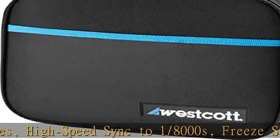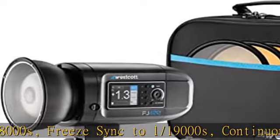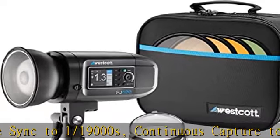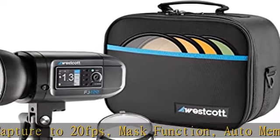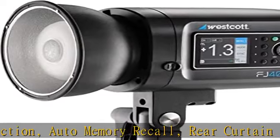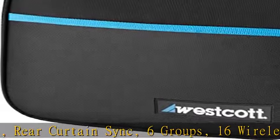Unrivaled performance and stability. Removable AC/DC 14.8V 4400mAh 65Wh LiPo battery pack with DC power for on-location freedom and trickle charge when connected to AC power, with stable color temperature of 5500K plus or minus 150K over the entire 9-stop energy range.